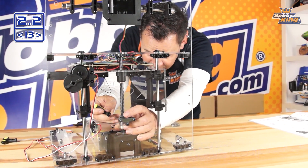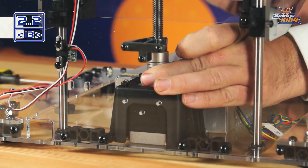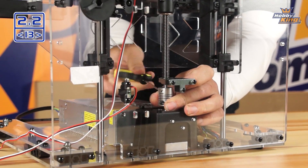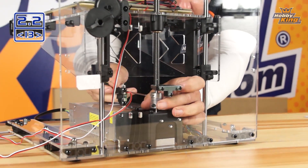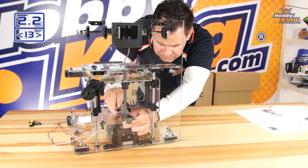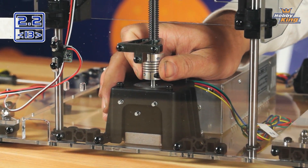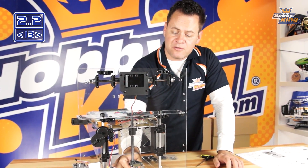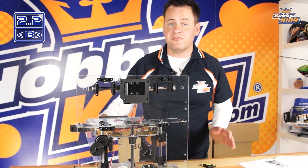All you're going to need is the 2.5 mm hex. Go right in here, loosen that up, slide it down, eyeball that it's centered, and give the top one a snug. Rotate it so you can get to the bottom collar, give that a snug, then grab the shaft — when you rotate it, you're going to feel a cogging, and what that is is the magnets and poles lining up in the motor. That way you can tell it's positively engaged. We're all finished up with that step. Let's move on to the next step, which involves the side panels.